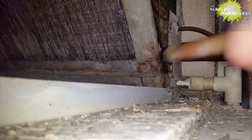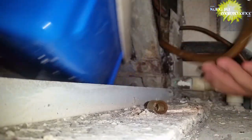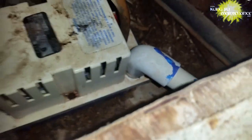This one is plug and play — you can push the hose in — but as an added benefit, I think adding a clamp where it inserts over the port is a good idea. I absolutely hate condensate pumps as I said earlier. They take a lot of maintenance. Using condensate tablets once every three or six months is definitely a good idea. You can put them right in the condensate pan. They are anti-mold, anti-coagulant — that means they prevent the dirt from clumping together so everything can flow out freely. Condensate pumps take a bit more maintenance — what can fail does fail.